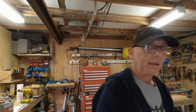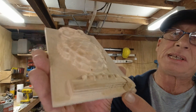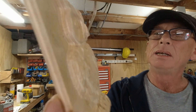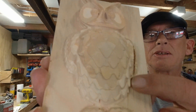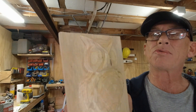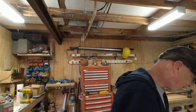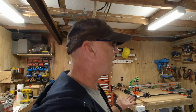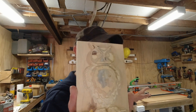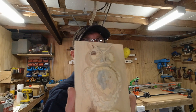After the lizards I tried an owl, but for some reason the software uses a post processor and it didn't raise the Z — it just cut all the way through and then ripped this bit off at the bottom. The actual owl looks really good. After that one I did another one a bit faster. I'm trying all the time how deep and how fast I can make this go. This one was cut at 1mm deep cuts at 30mm a second.